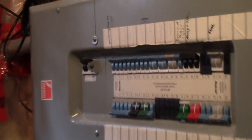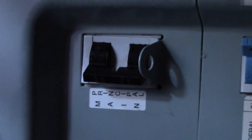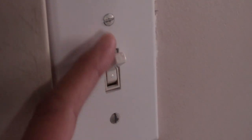Always safety first. We have to turn off our main breaker. If you know which of the smaller breakers the light switch belongs to, that's okay. But your safest bet — and I mean your safest bet — is to turn off the main breaker right here. Now let's double check and turn the switch on and off. If the light doesn't go on, you know you've done the right thing by turning off the breaker.